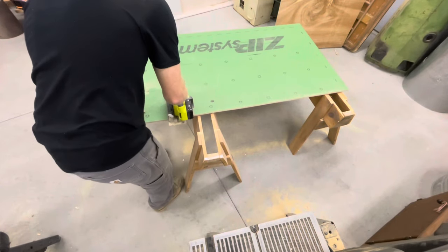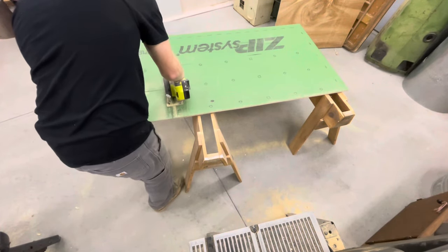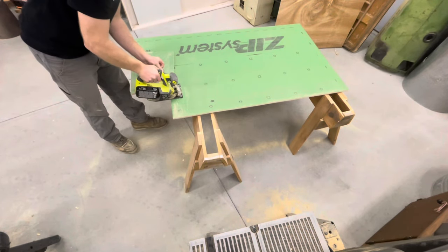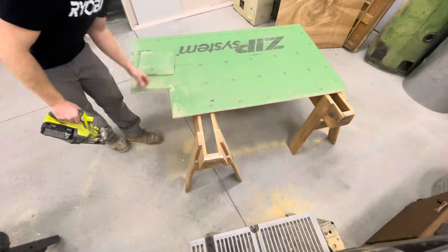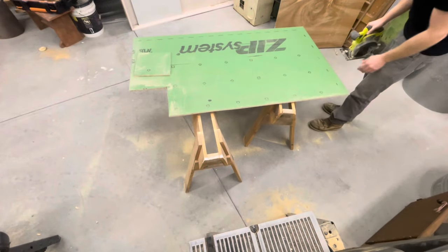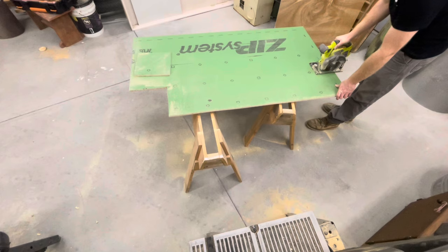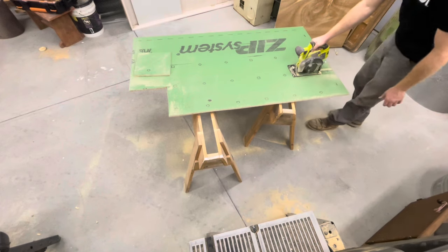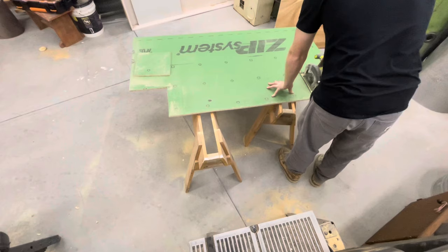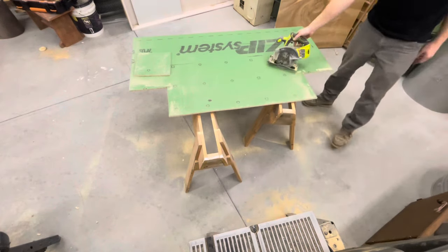The plywood was cut extra tall to allow me to attach the headboard to the wall, as this will be a free-floating headboard. I cut two notches on the sides at the bottom of the plywood, as this will be the part that is below the bed frame and screwed into the studs. We will also be attaching screws at the top of the headboard — I have a little trick I'll show you later. In total, we will have four screw points.